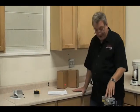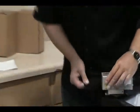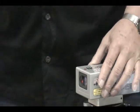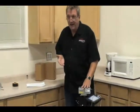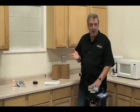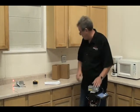The other thing is a dirty lens. There's a glass lens right here and it doesn't take much to clean it off — we give you a nice little microfiber cloth. If you look at it and it's full of dust, you wouldn't want to look through a pair of glasses with that much dust on them, so let's not expect the laser to measure accurately either. The only time it really shows up fast is when you're measuring five or six hundred feet outside. If the lens isn't clean, it just won't give you a measurement.